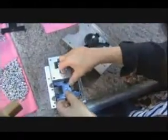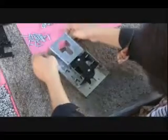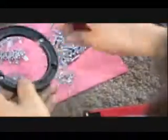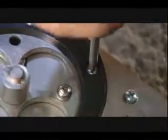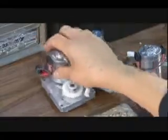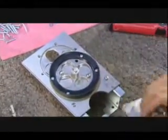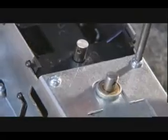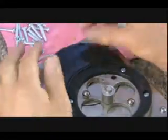This is precision work. First, they set parts in a metal casing. Plastic rings go around the discs to guide and support the gears. Then they attach the gear train motor that powers the discs that dispense the correct change. A plastic guide on the casing helps the coins drop in properly.